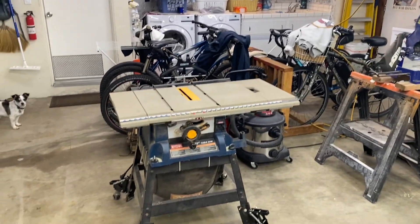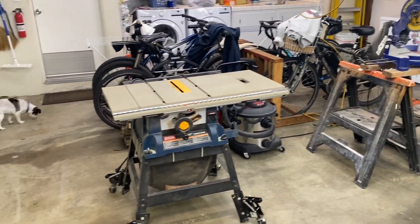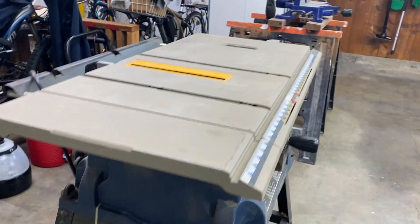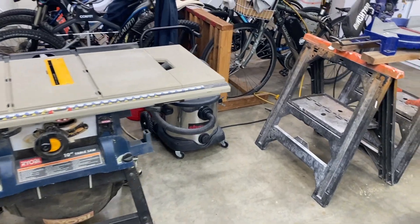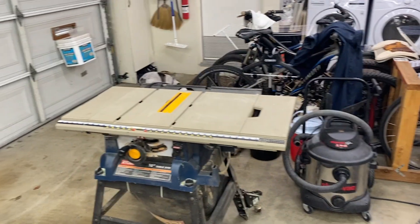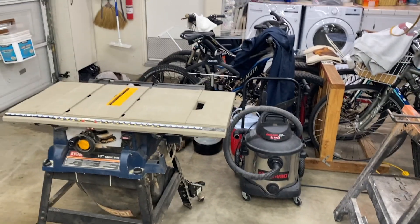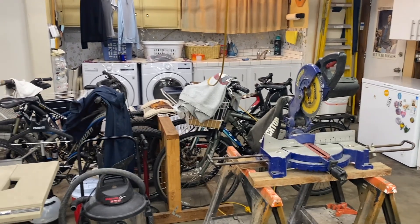After a little bit of fiddling, I put the table saw on the right — but I'm really not going to be using the table saw much for this project. I want to make sure that blade is all the way down so it doesn't catch on things. It's mostly going to be the chop saw, but I really need an infeed table, so the table saw is going to serve as my infeed. I'll prop it up a little bit to make it level so the long pieces have support.